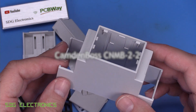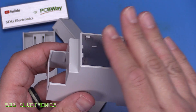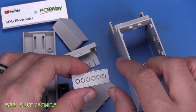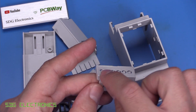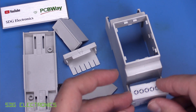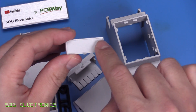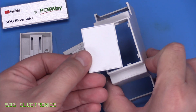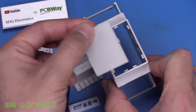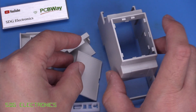These are quite nice because they've got various modular options. They've got clips that can hold PCBs in various positions at the top or right down at the bottom. They've got end pieces where you can punch out however many terminal blocks you're using and just expose those. You also get another one for the other side, or a blanking plate if you've only got terminal blocks on one side. There's also a plastic cover which you can drill holes in and stick labels to if you've got LEDs, and you can put a PCB right behind it for indicators or displays.